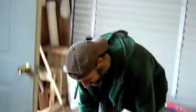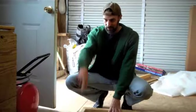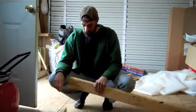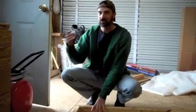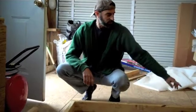Here we go with the building of the aquaponic troughs. The first step is to build a 2x4 frame, which will be the top of the trough. We treated our 2x4s, and we'll attach an 8-foot 2x4 to a 54-inch 2x4 for the end caps. We'll screw them together on both sides, and that will be the top rail of the trough.